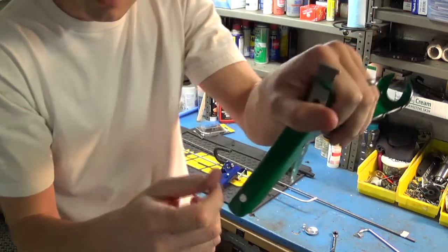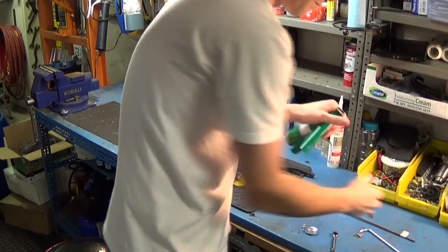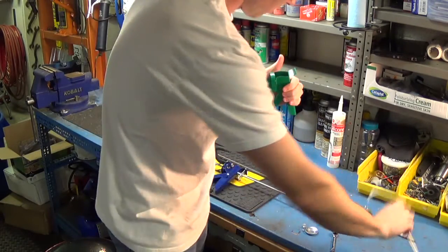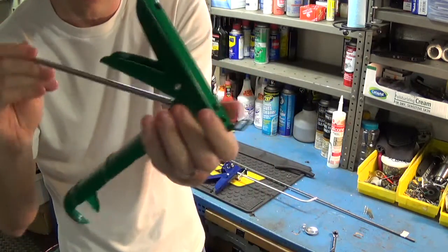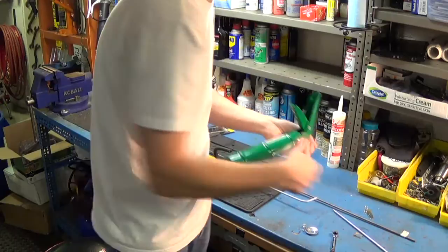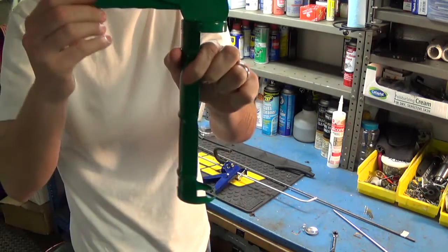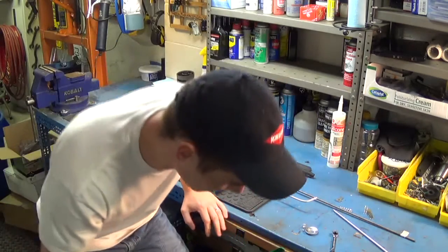Take the back plate and back spring off and set them to the side. The internal spring and little rod are still inside. To get those out, take the rod you just removed and, through the bottom of the caulking gun in front of the handle, just tap them right out. Now there's the larger plate and the larger spring from the internal part, and the handle will move freely. When we reassemble it later, it's very easy to put back in place.